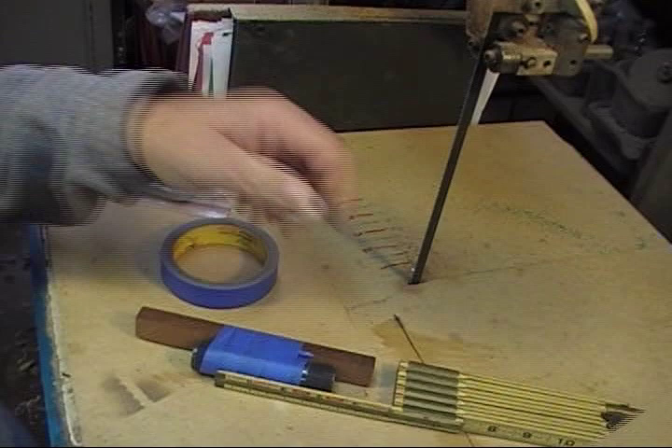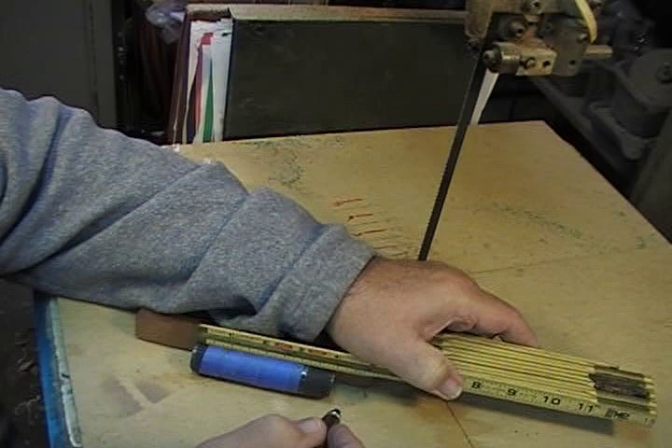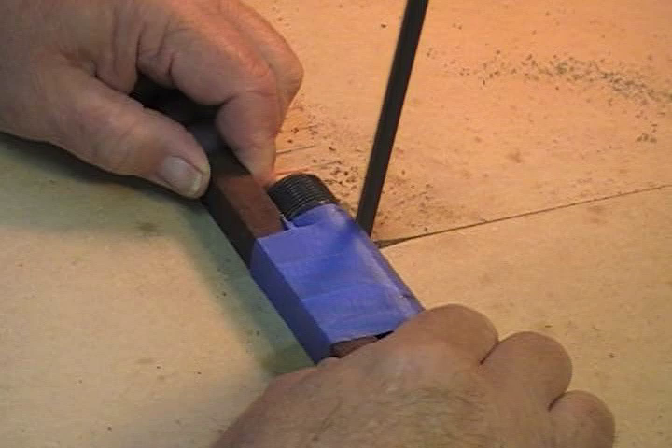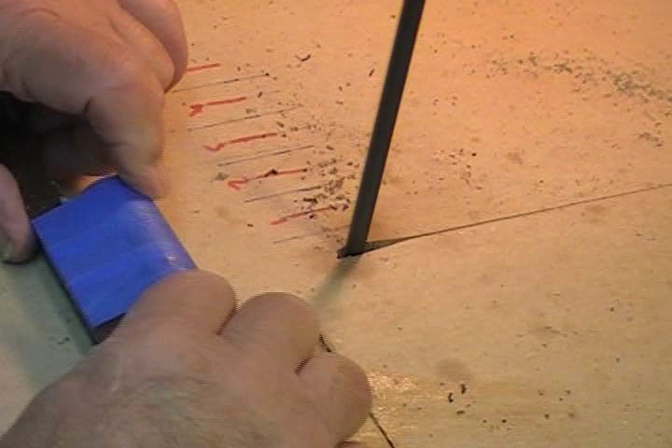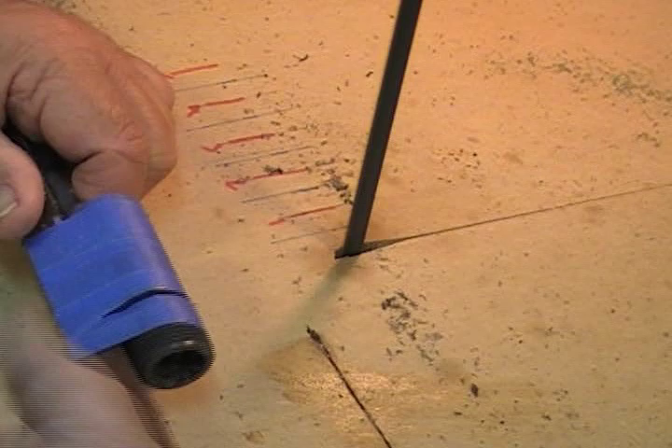I want a 2-inch piece of PVC, so I'm going to mark it just off the threads. You lose about 3/4 of the threads on each end of this, which is why you do better buying in multiples. After I've got it marked out, I'm going to cut it on my bandsaw. I didn't have that side grounded — did you see it jump? The safety thing didn't work out because I didn't pay attention. Second side goes much better. The grounding keeps it from bouncing, and the square stick keeps it from spinning and burning off your fingertips or hurting you even more.